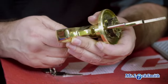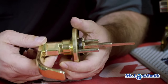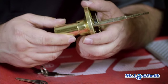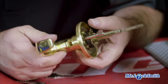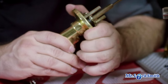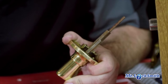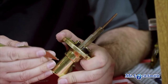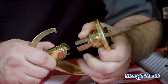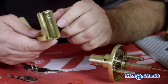The lever is about the same. Make sure it's unlocked. On a quality lock the hole is right here, but where's the hole on this one? It's on the opposite side — that's why I take it off the door; I have to spin around and look at it. Turn the handle until you can just see it's a slightly different color. Depress it — you don't have to go crazy — and pull it off. And we got the handle off.